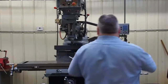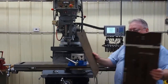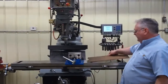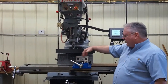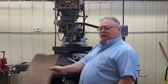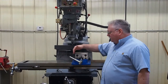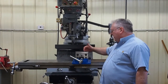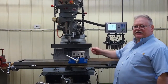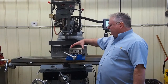You may have noticed that these boards are different lengths. The reason we do that is because we like to offset our vise from center — if we do that, the boards have to be two different lengths. The reason we offset the vise off center is that if the vise stays centered, the wear area would typically be within about six inches right there on the vise. So after years and years of use, all of your wear is going to be concentrated in that area.